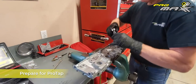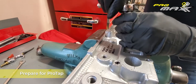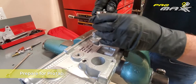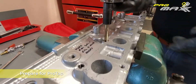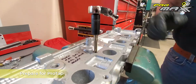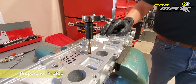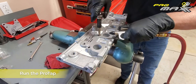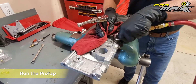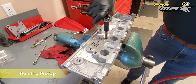We're going to get started with the tap and just go ahead and get it going — you can see how easy it is. Now, the proper way to use a tap: as I'm moving, I want to back it up at least a quarter turn, and then I'm going to blow down through each flute to clear out all the debris. I'm blowing down the flute, turning it back, blowing down the next one — just to clean anything out that might be in there. Now I'm set. I've got a clean tap and I can keep going forward.